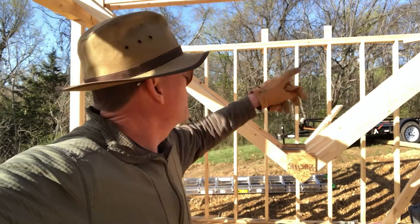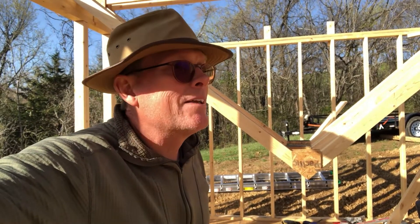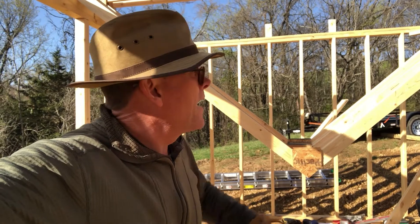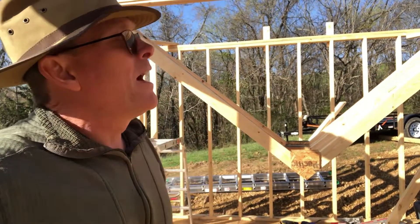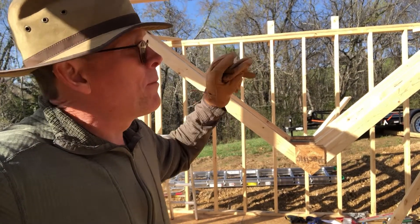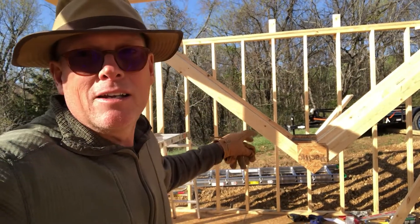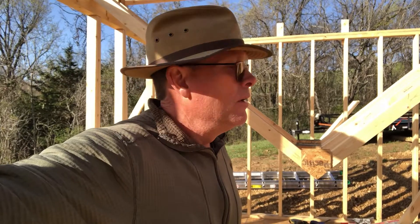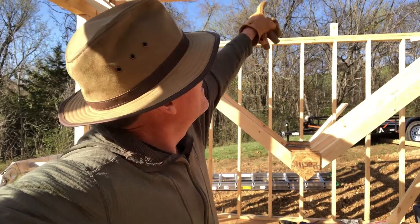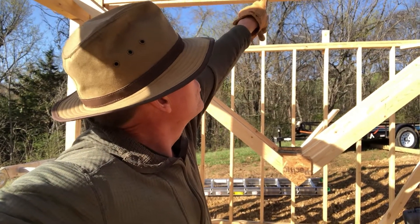Alright, let's get started. I've pulled these trusses out — I had them strapped to the walls while I was gone for about 10 days, just in case of wind. Now I'm going to lay them out, put them out as best I can as far as heights, prop some up, and see how they work. Then I'll figure out what cutting I need to do to make sure they're all the same height, and then create the king posts to put in between the peak and the lower chord to lock these in.